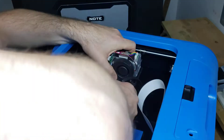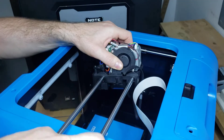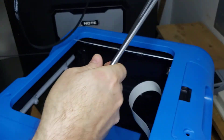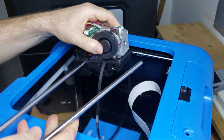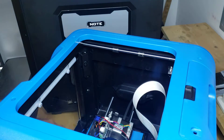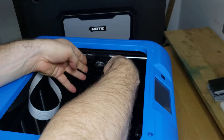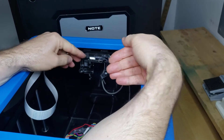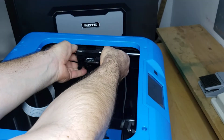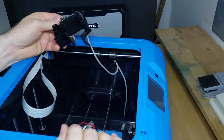There's one important thing I want to show you. When you put it back together, you'll put the rods in — make sure your belt is not tangled. For the motor side bracket, it's pretty much the same process once you have the rods off. Take your belt out and pull the bracket towards you — that's the only difference instead of pushing it away, which actually makes it a little easier to get off because it doesn't get caught on the back of the printer.